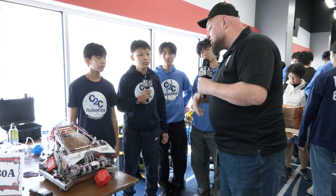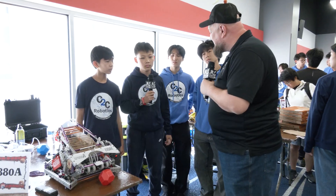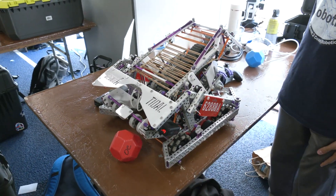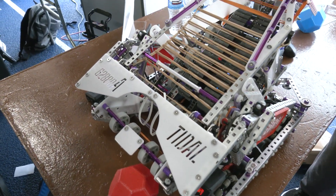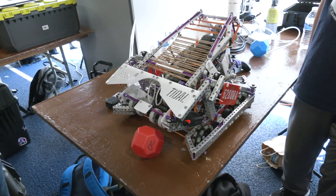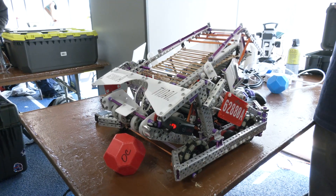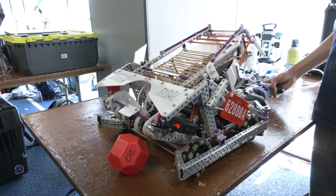William, let's dive into this robot. When designing it, we realized the long goals were really important to score points, as they gave a control bonus of 10 points. So we decided to make our robot fast and maneuverable around the long goals. We gave it a tray that can move up and down, allowing it to move under the long goal and defend it more easily. We also gave it a front and back intake, so we could drive into the loader and back right into the long goal.